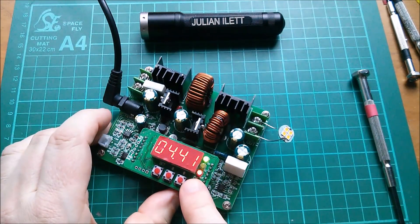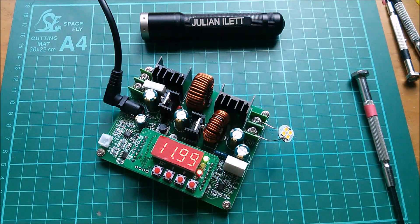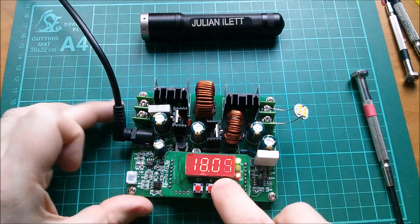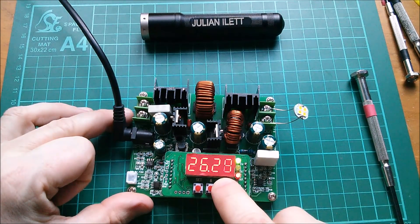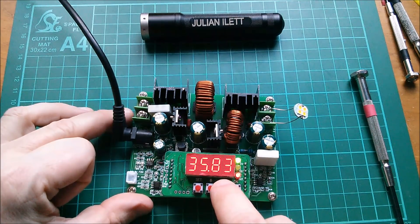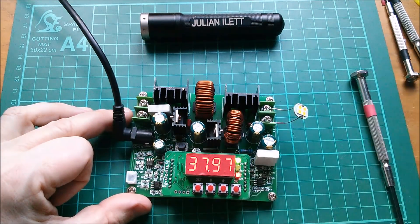So I've set this one to 20 milliamps, 12 volts, which should be just enough to light up four regular white LEDs - not very bright probably. Switched on, 12 volts coming out, no current of course, and no - it doesn't light up. So now I'll start winding this up in voltage. Nothing yet at 20 volts, nothing at 30 volts. That's the inductor buzzing. This is the D3806 - it goes up to 38 volts. Let's take it all the way up. Even at 38 volts, there's still nothing happening on that LED. So maybe it does need a higher voltage.